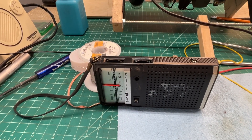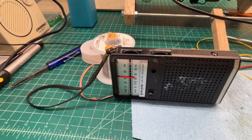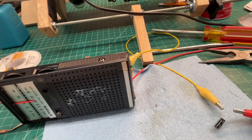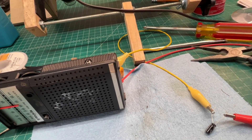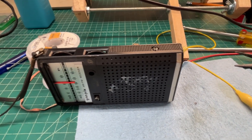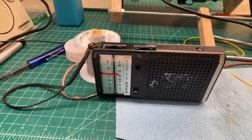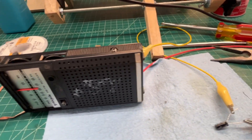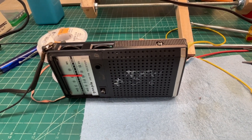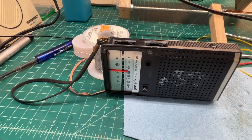One thing that's common — you can hear the speaker has kind of a high pitch again — is the shaping of the audio signal. I actually add a capacitor across the speaker terminals, around 47 microfarads, to kind of reshape the audio, remove some of the treble, and pass more of the bass. It's really a personal preference based on the way this particular little speaker sounds.